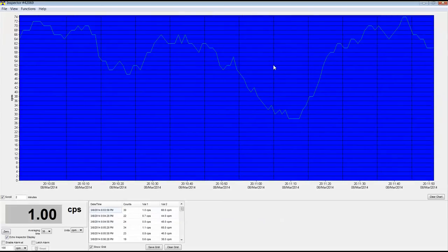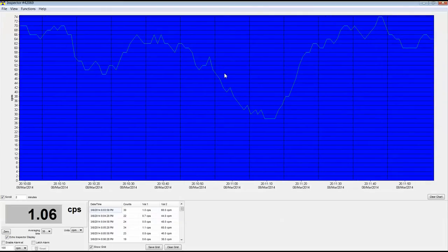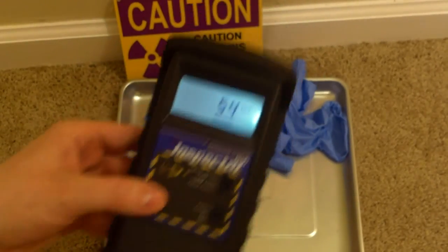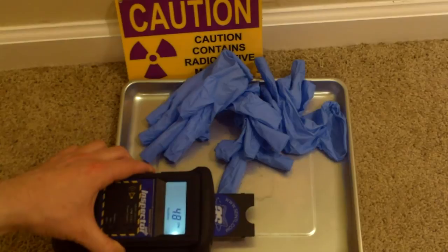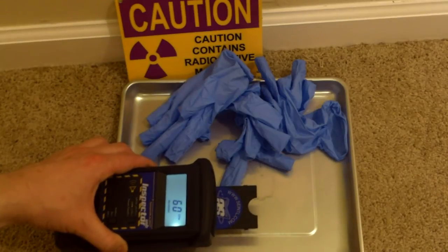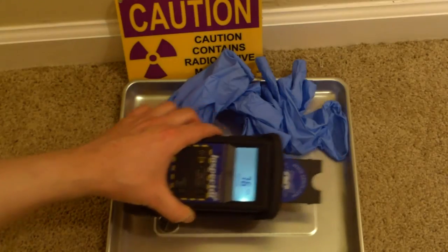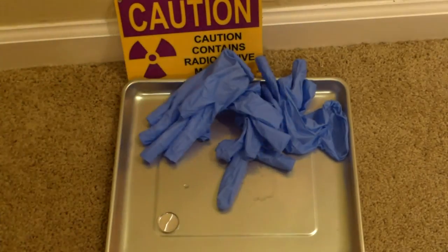Alright, so now we've messed with our barium-137M generator. Let's go back now and see, it's been over 30 minutes. Let's see whether or not everything has decayed back down to normal. Alright, so here we are back with our material, and we can take our inspector, which already has a pretty high count rate over in this area, open up the back, and inspect to see whether or not everything's back to normal, without touching anything very carefully, because we don't want to touch the unit. You can put the unit in a plastic bag if you are testing something a little bit more contaminated than this. But as you can see, everything has gone pretty much back to normal. And of course, this is a predicted result from barium-137M. And now we know we're probably safe.